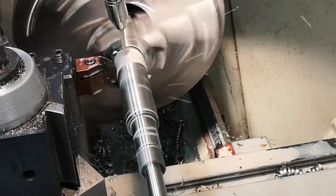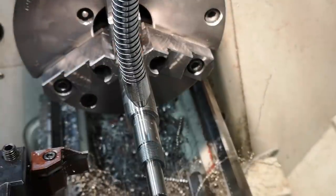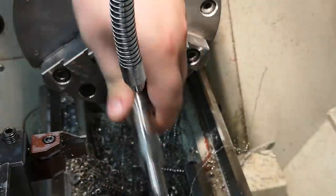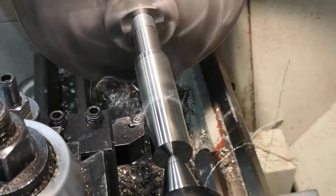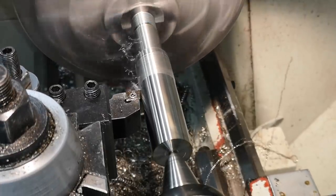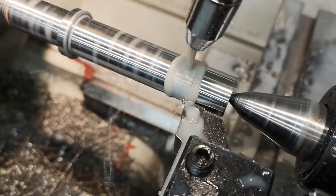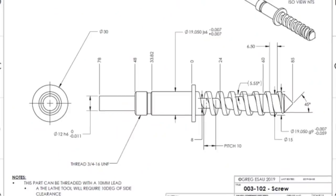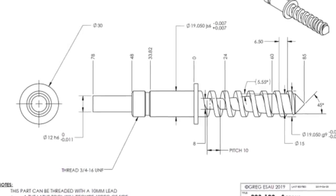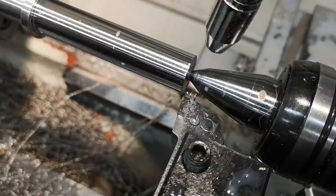Not designing something that can be easily machined is a pretty rookie mistake. We've all heard stories of parts that had to be gun drilled because the junior engineer accidentally set the hole wizard in SolidWorks to 'through all' instead of 'blind hole 12mm deep.' Peter Stanton would then shrug and start work on a new drilling fixture. Modern machines make it much easier to be sloppy. If I designed the screw just like this for work, I wouldn't have felt too badly about it and I probably would have sent it out. Any machine that can cut the gullet of an auger like this should be able to do a taper as well — they could probably have even varied the helix without too much difficulty. This would be made on a CNC lathe with a live tool and probably hand-programmed since the moves are fairly rudimentary. Provided I can communicate what's needed to the machine shop, the machinist will be able to handle it. If I had to spend cold hard cash on it, I probably would have done more heat transfer calculations to make sure the screw wasn't too short.